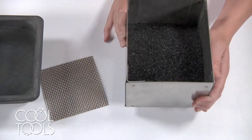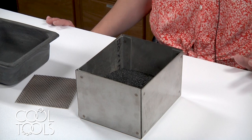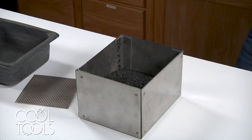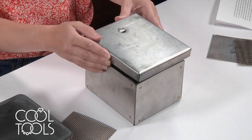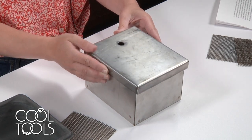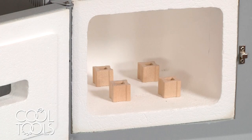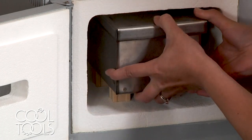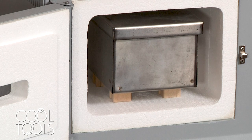Give your container a little shimmy to settle the carbon down. One last thing to check before putting your work in the kiln is whether there are any instructions regarding the lid. Cypress Copper Clay recommends either a vented lid or leaving your lid ajar, so place your vented lid on top and you're ready to head to the kiln. With your posts still in place from the first phase firing, place your firing vessel on top of those posts, then consult your instructions and program your kiln for the second phase of your firing.